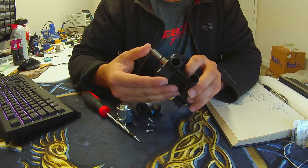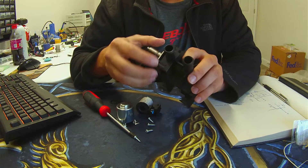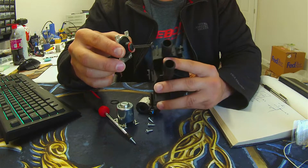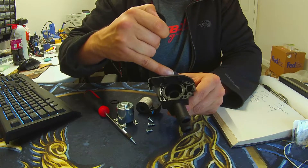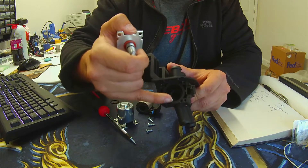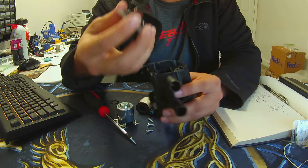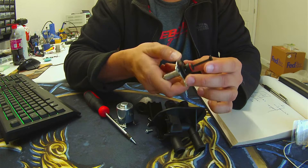It's just a spring return valve, well sealed it looks like. Nice fat O-rings — it's got a sealing surface there and the rubber O-ring is going to seal up to that. So when this thing is spring returned and open, it looks like fluid comes in here and travels upwards through the cavity and then out this port. When the coil is energized, it's going to press this into the down position and seal everything up. It just has a little bit of a diaphragm seal here.